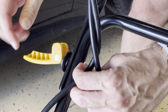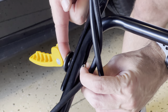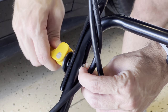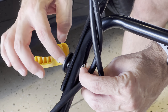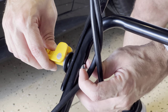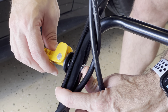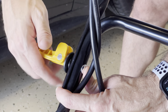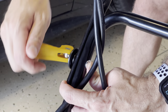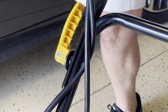Remember, don't tighten this too close to the pipe because when you go to lock it, it'll be really hard and you could break it. Leave enough space so that you can lock it, but it's not too hard to close and not too loose. Maybe one more turn and that should be good.